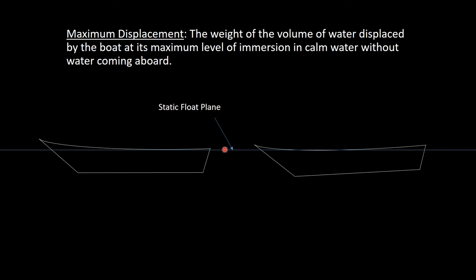This waterline is called the static float plane when we've got the boat just on the verge of swamping. Now in the first case here, we just push straight down on it, keeping the bottom level, and in the second case, we kept the bow and stern an equal distance above the waterline. The Coast Guard allows you to use either of these two approaches, provided the bow is above the highest point